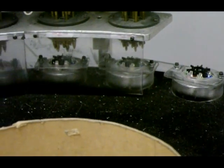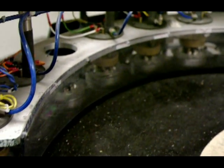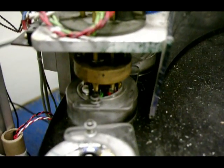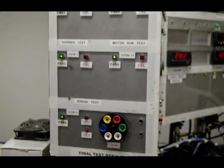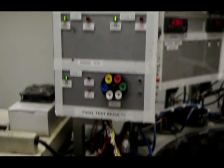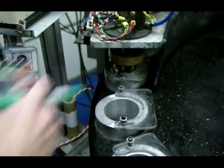After the burn-in phase of the testing, the capacitors are cooled before going on to be tested further on this table, where they are tested between each terminal to the case and each terminal to terminal to test the barrier. Also, they are tested twice with the motor. Finally, they are tested for capacitance and DF, which is a quality indicator for the long-term health of the part.